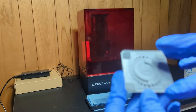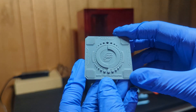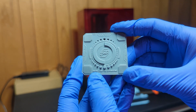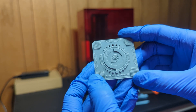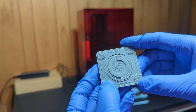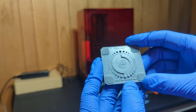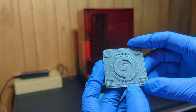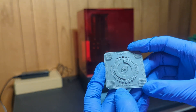Overall, if you look at the letters — they're all there. There isn't anything missing. If some of the smaller details were missing, or the smallest peg may be missing, then it doesn't have enough exposure time and you need to increase it. On the other hand, if it looks really bold and filled in, then your exposure is too high and you need to lower it.